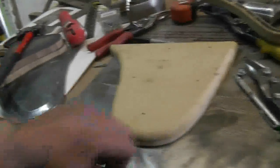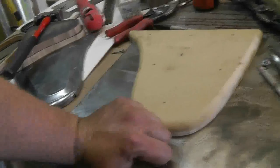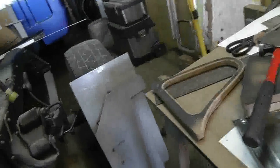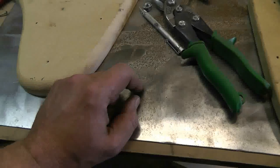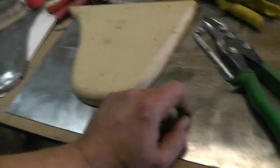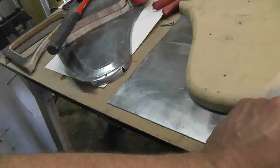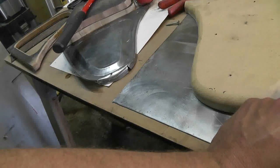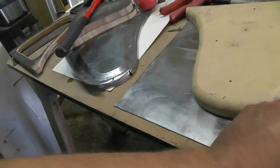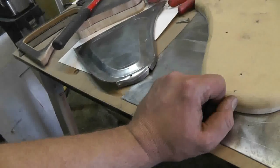I'm wasting a lot of sheet metal trying to do this, but I've got another $29 sheet sitting there and some other pieces over there. I've noticed those other pieces seem harder even at the same thickness, so I don't know that they'd be the best for metal shaping. The reality is maybe I should be looking for aluminum-killed steel, which is supposedly legendarily easy to form — I've heard it exists but apparently you don't really need it.